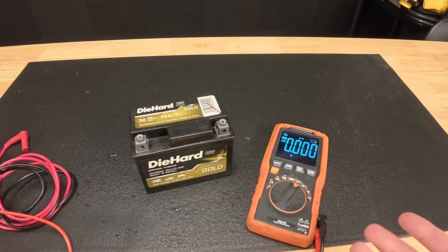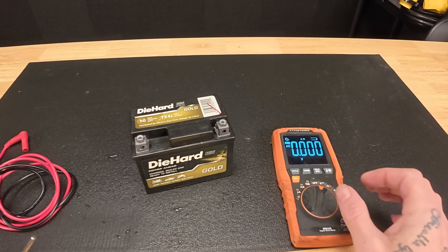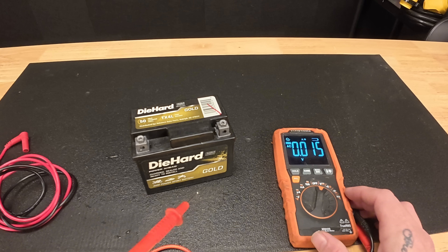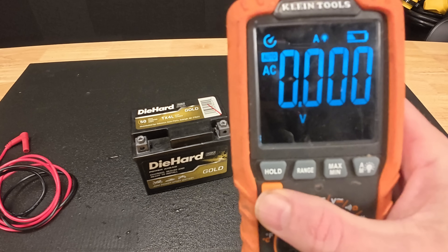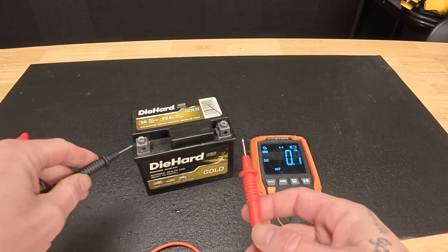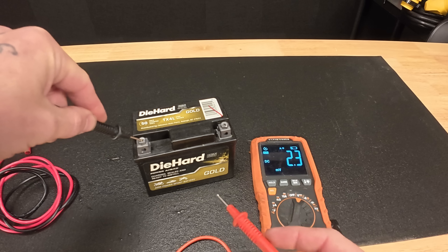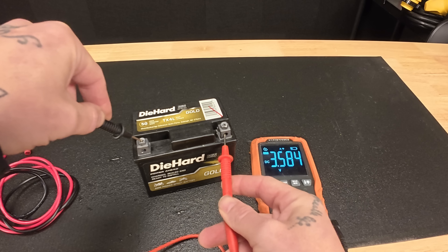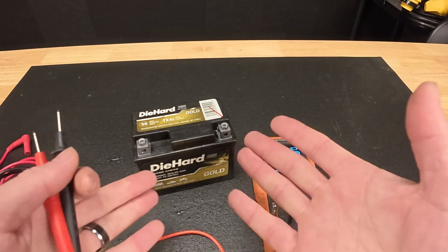Let's take a look at an example of what we can do with a multimeter. Here I have a small battery — kind of like the one on your RV, just a lot smaller. Batteries use DC voltage, so we go to the meter, press the select button, and it goes to DC volts. We can check what our battery has, and this battery has 3.584 volts — which is not good. Notice that decimal: it is 3.584, not 3,584. That's one check you can do with these things.